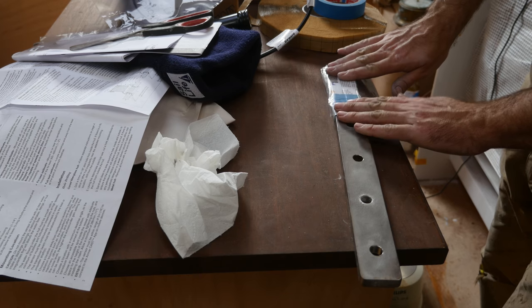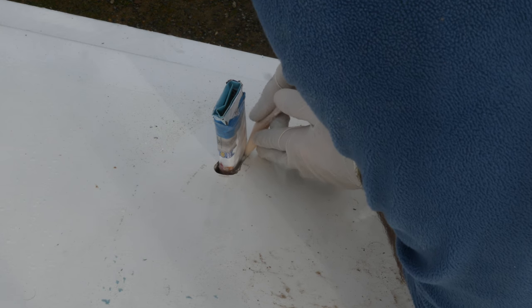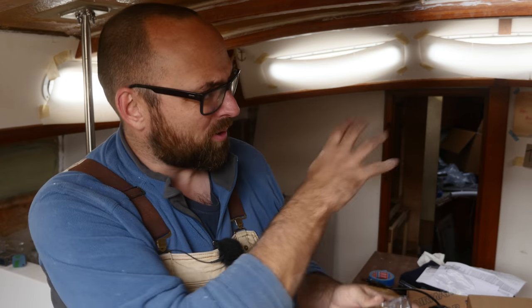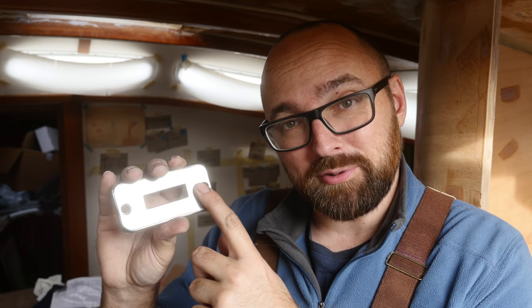I'm gonna add some plastic and then fill the gap in between the chain plate and the deck with a little bit of thickened epoxy — not to seal around the chain plates, just to take up a little bit of this gap. Turns out captain dumdum here made yet another little mistake: I forgot to drill the holes for the cover plate, and of course I want those holes to be sealed and I can't really fit it now because it's all covered in thickened epoxy up there. Maybe if I'm lucky the thickened epoxy will have cured enough tonight that I can go ahead and fit the tiny little cover plate, mark the holes, get those drilled and sealed, so I can do the final installation of the chain plate tomorrow.